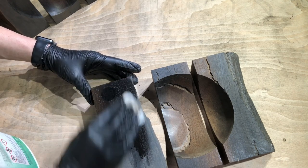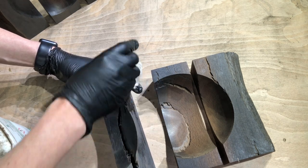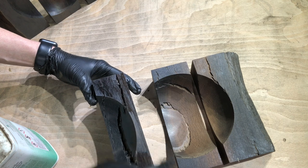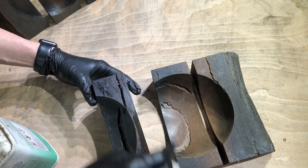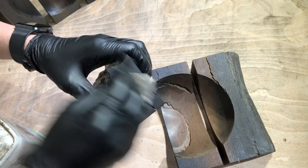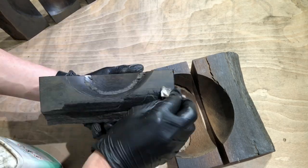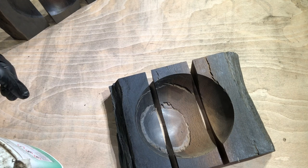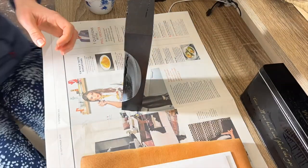Very pleased with the way they turned out. I do take a lot of care over the finish on my pieces. I don't want any sanding lines whatsoever. So I always run the sandpaper on pieces like this with the grain. And bog oak, it's pretty amazing stuff to work with actually. Nothing spectacular about the other one, so I won't bother showing you me sand and sealering that. I'll get those done, get those denibbed, get them waxed, and then off to Lenore.